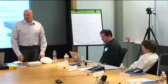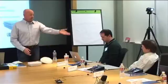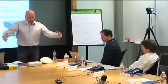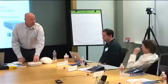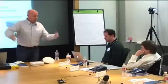Wireless is a shared medium, right? If I have 10 megabits of shared medium to give, let's talk about the old hubs. Well, that's why we went to switches, so we have dedicated bandwidth to you. So this is shared medium. Theoretically, in this area, if everything's perfect, I can have a cell that'll support 900 megabits of data. We've designed the 466 and 466R to allow enough antenna separation so you're not going to get interference with each other on the radios internally. So you have enough capability.